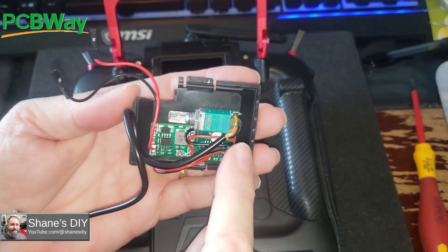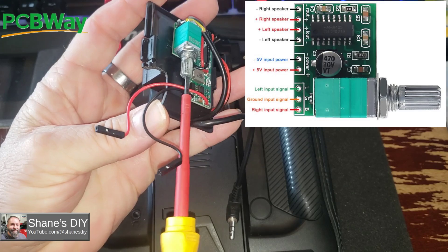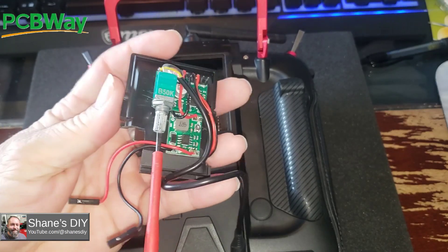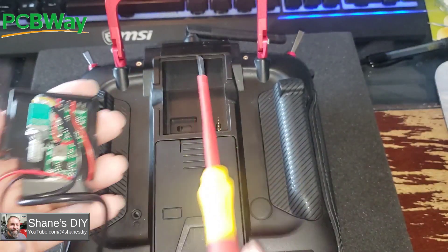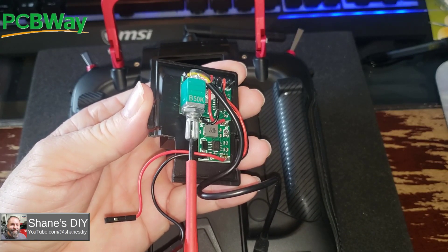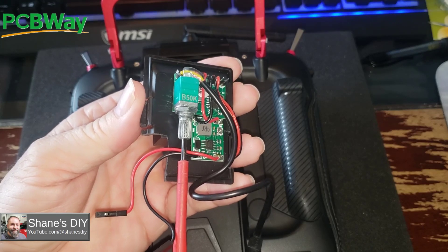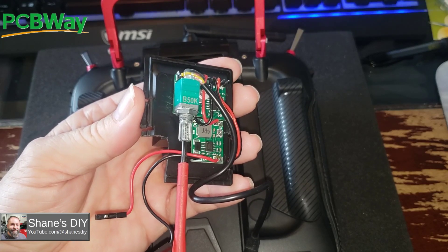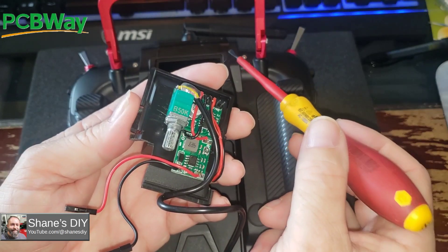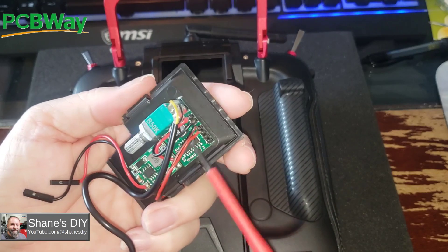This first part is just a little amplifier. It actually has an on/off potentiometer on it. I've got some that don't have the potentiometer — you can't turn them up and down — I haven't tested it yet, but it could work pretty good. We've got plenty of room in this module bay. You can actually turn it on and off with this, but since it's not sticking out, it's not really convenient to mess with. So I've just got it preset at roughly 50% volume on this amplifier. The volume knob that I've got programmed into my S1 on the radio still controls this because it controls the headphone jack.